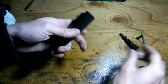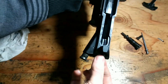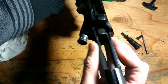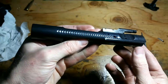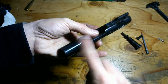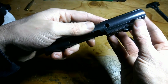Another thing people don't really know: the carrier itself does not make contact with as many places as you think. When it's inside the upper receiver, you can see that it's kind of loose towards the back, but a lot tighter towards the front. That's because the carrier doesn't actually travel along the entire surface — it just travels on these four rails. So when people lubricate their carrier, they'll lubricate all these parts, which is fine — the lube will spread itself around. But all you really need to address are these rails, and anywhere you see your gun wearing.